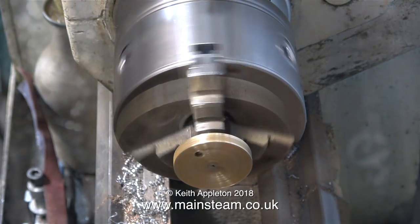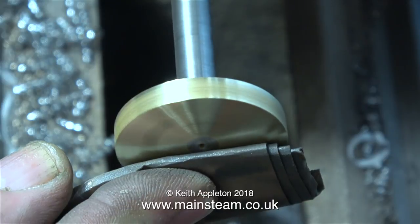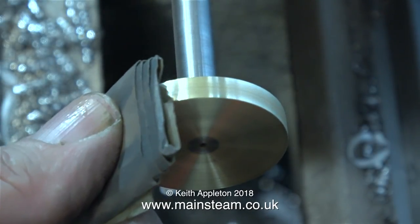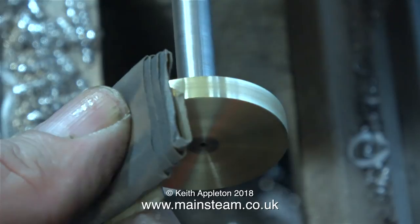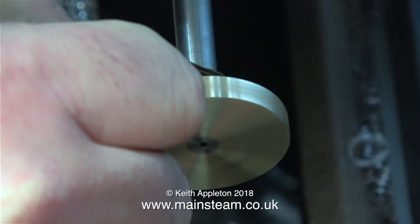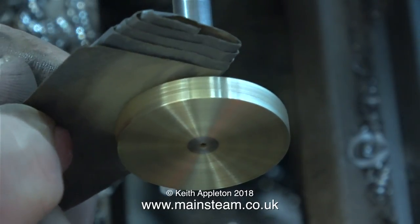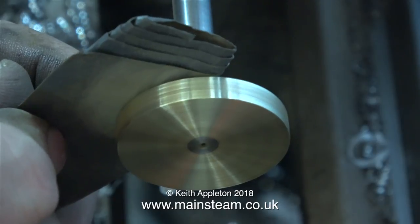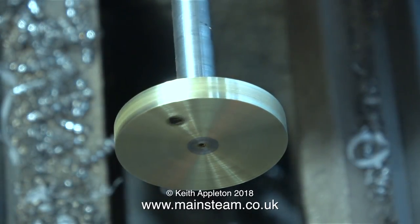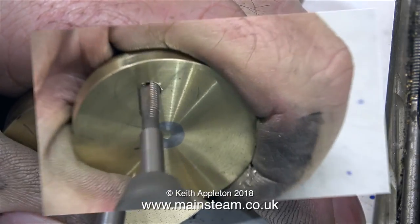The question is, what do I do about this? Do I make a complete new one-piece crankshaft which I can turn from the solid? In this clip you can clearly see that the further the crank web gets from the chuck, the more it wobbles. If I make a new crankshaft it will have to be oversized because the bearings are a bit worn. With this particular engine I'm not going to get bogged down with technicalities — it is, after all, a very old brass engine, and brass is a very unsuitable material for making steam engines from. It's fine for the tiny oscillating cylinder things, but at a certain size it doesn't wear well. If the parts were made from gun metal it would have been much better.